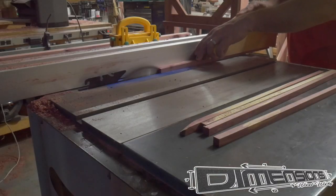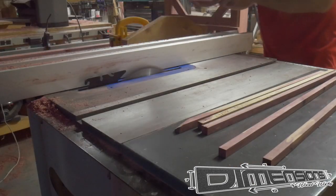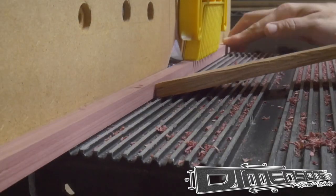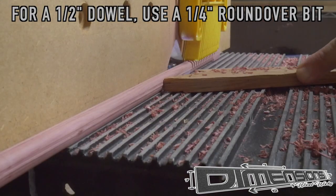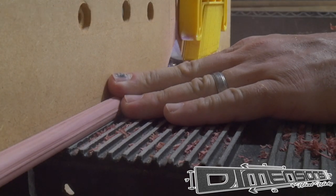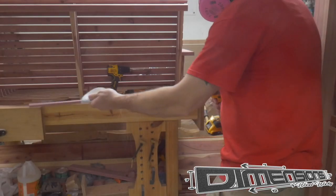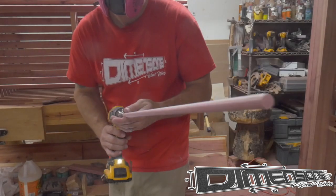Now it's time to finish off our cup holders and armrests. And if you're like me, you can't buy cedar dowels to match your swing, so I had to make some dowels on my own. Using a great tip I got from Tamar at 3x3 Custom, I used a round over bit — half the radius of what I wanted my final dowel diameter to be — then just ran the round over on all four sides. I cut those ends off and chuck it up in my drill to give it a nice final sanding and we end up with pretty uniform dowels.